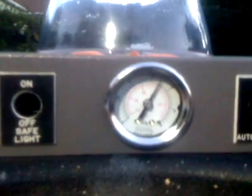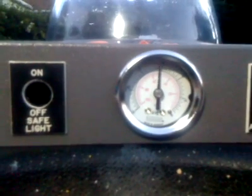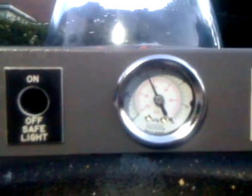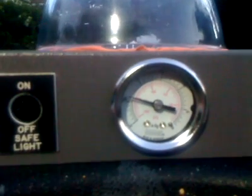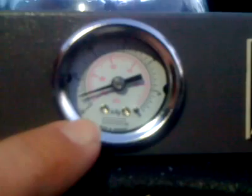That's sealed down and that's minus 10 inches, minus 15 inches, coming up to minus 20 inches mercury. It's so slow. And we've got minus 25 inches and a little bit of water I had inside — just don't think there's anything going on with that yet. Don't see any bubbles; the only bubbles were from air leaking in initially, but nothing boiling, which is what we're interested in. And now we are at just over minus 28 inches mercury.